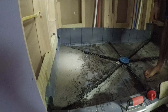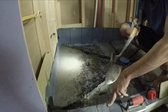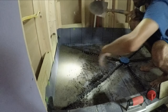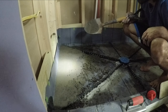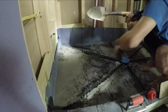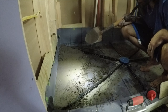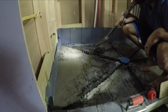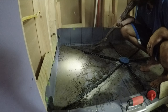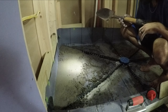As you can see, I'm just basically coloring in the lines. I'm filling everything up to these reference points — the sticks. That's what they're designed for: they're supposed to be used as a reference to keep your slope. It looks like it's going pretty well so far. I'm going to trowel right over these sticks in the end to give myself the solid, smooth surface that you need to tile on. I think I'm going to put a time-lapse on here — catch you guys in a few minutes.